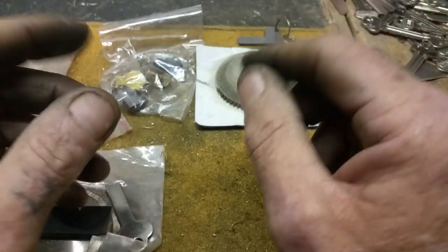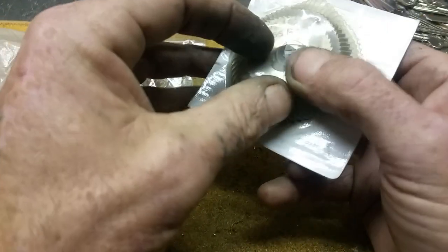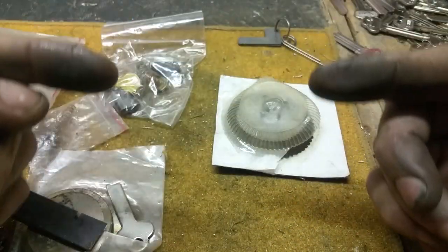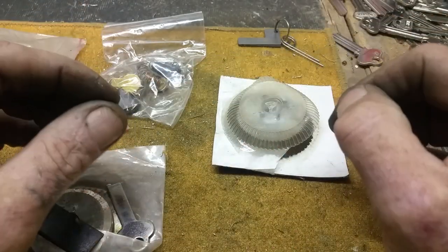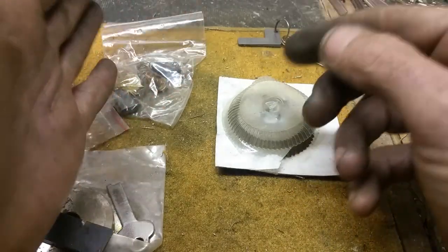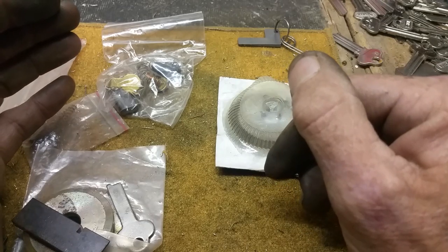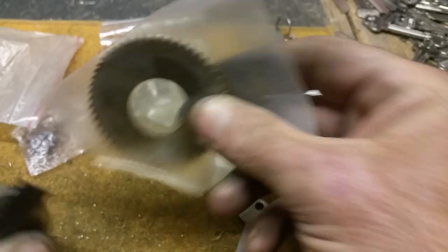With the final adjustments, I don't know how it's set up, but what you need to do is go to Dr. Locke, one of his videos. He's got a 007 duplicator and shows you how to do the fine adjustments. What you basically have to do is get two generic blank keys, which are exactly the same height on the blade, put them in both jaws and adjust the adjustment side until that cutting wheel is just barely touching the surface of the other key. That's the way you adjust them. Anyway, if you go to Dr. Locke, it explains it a bit better than me. So bottom line, without that cutting wheel, you're not going to do flat keys with that, mate.